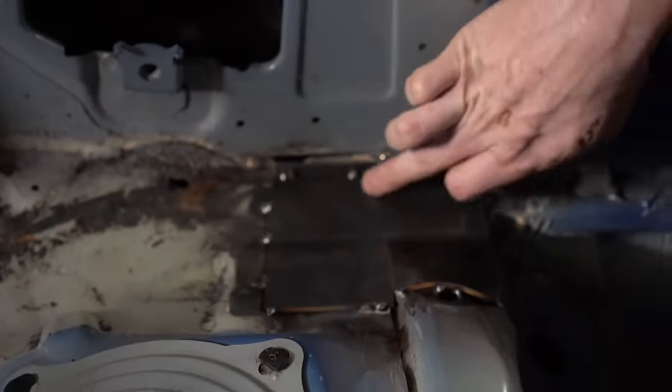Okay, so we're at the point where we're putting in the last piece, and as you can see, I've cut it. I notched these larger copes first, and after notching this side, it turns out it's a bit too long, which is perfectly fine. I can easily cut this notch again, and I can match up where it should be cut approximately just by scribing beside the tube here. But you just really need to be careful when you do this, because you can take as many cuts as you want to get down to that length, but if you take too much, you're screwed, because once it's too short, there's no way that you'll be able to make up that difference.